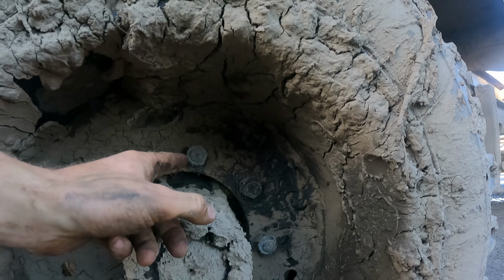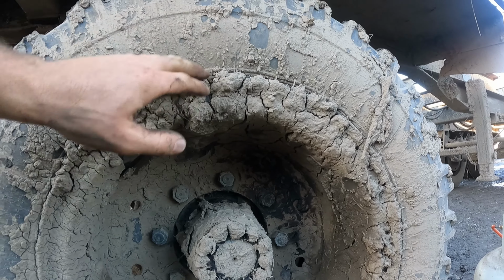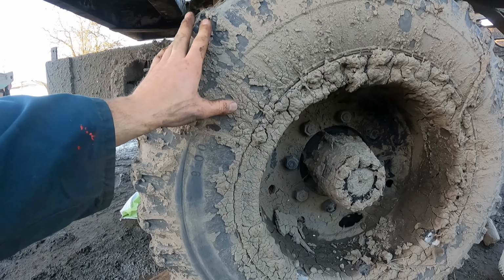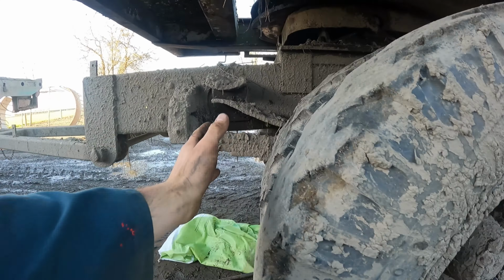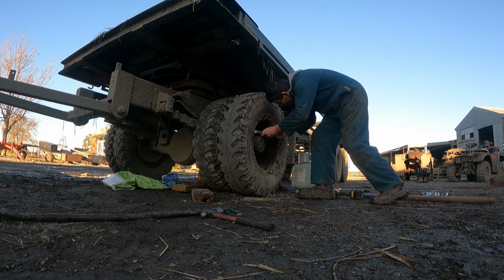So obviously putting so much heat into the nut, it may spread up the rim and into the tyre, bursting the tube and popping the tyre. Now I don't want to do that, because this wheel here on the outside is still good. It's the one on the inside that is the flat one. So I've got another idea.